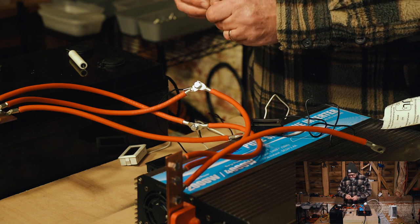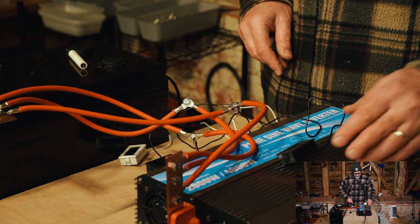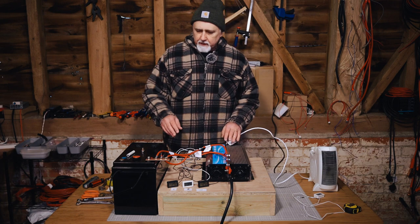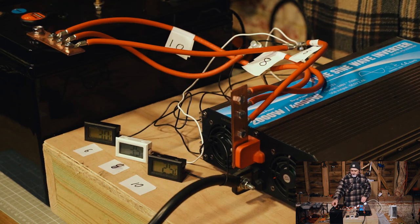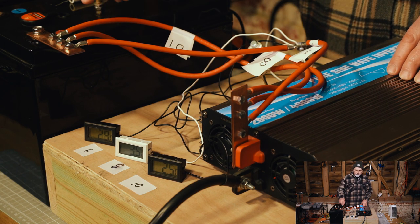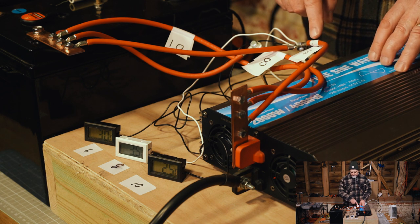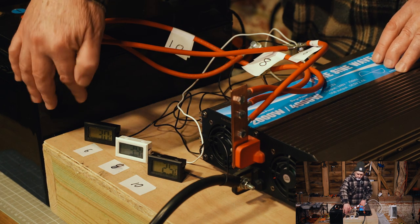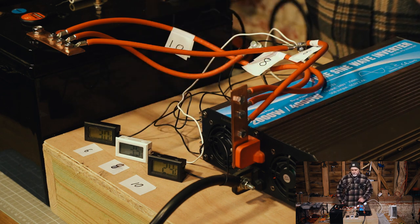And the final cable. I'm going to torque these up now, but just to explain the whole setup end to end. We're going to run this black cable straight off the negative terminal of the battery — I need to first use the resistor so we don't get a big spark. We've got three positive lines; these are 10-millimeter cables coming from bus bars on each side. We're going to torque the first one to 6 newton meters, the second to 8, and the third to 10 newton meters. The three temperature probes are there — you can see they're not exactly the same. It looks like the battery in this white one might be newer than the two black ones.